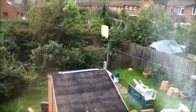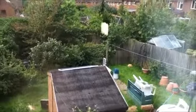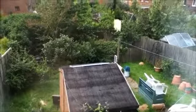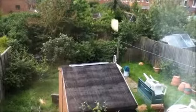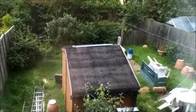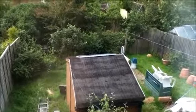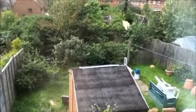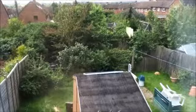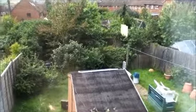When you put solar panels outside, they get covered in dust and grime and whatever's in the air, so every so often you'll need to go outside and clean your solar panels. I simply use ordinary window cleaner and a sponge. I happen to have the panels on top of my shed, so it's easy access with a ladder. Dirty panels will obviously produce less output, and that will lead to problems charging the batteries. If you look at your gauges and you notice that your charging is not as good as it was, and the weather has been good, that may indicate your panels need cleaning.